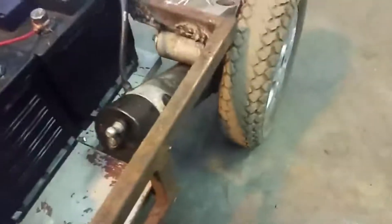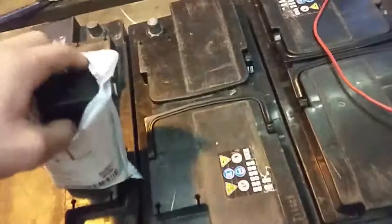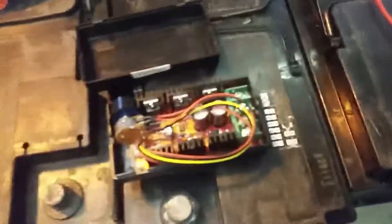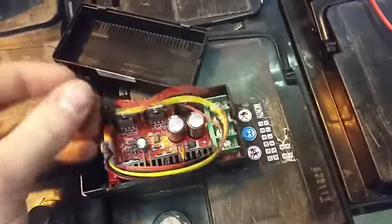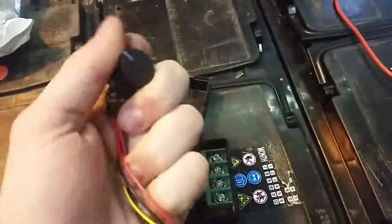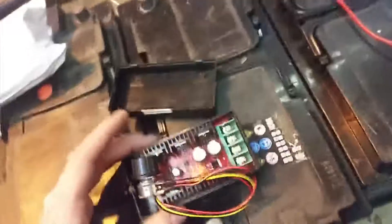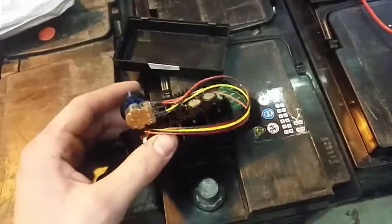Hello guys, I got a new package. I made a small little car with some mobility scooter motors. The welds are pretty baked on but they hold fine. It has a pulse width modulation motor drive. There's a small pot meter on it, so I hope it's capable of handling those two motors because they are 15 amps each at 24 volts.